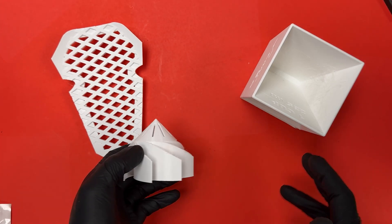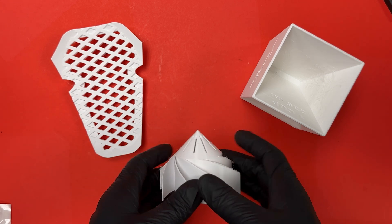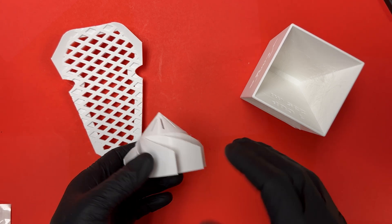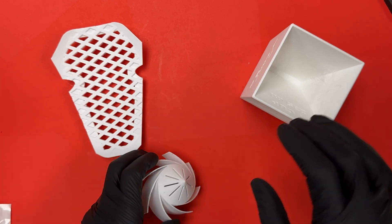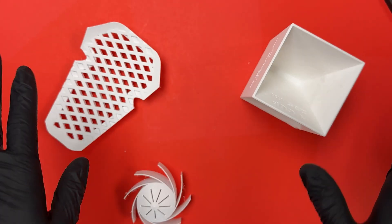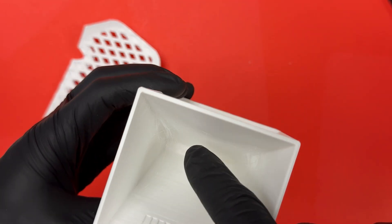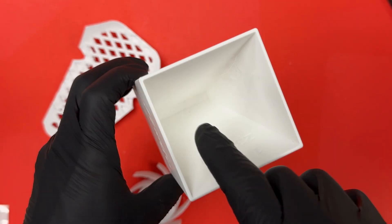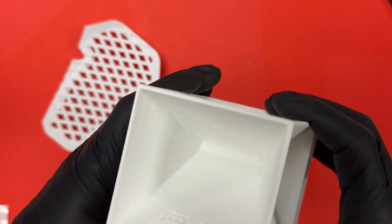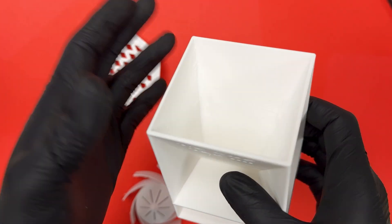White also has many different shades, so maintaining consistent supply is one of the main things we focused on when we introduced it into Teleport. But ultimately, when you're working with white, the main thing you have to work with is the cosmetics. White is the worst cosmetic material to print with because it shows every single possible little defect. This is an unprocessed part, but even those very subtle wispy hairs can be seen because you have white on there.